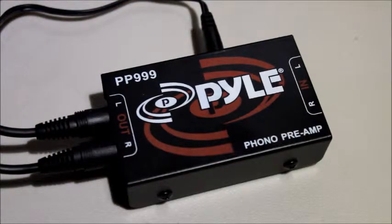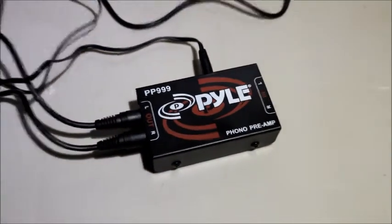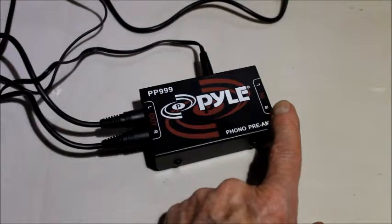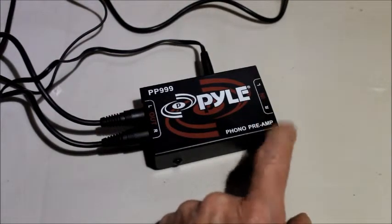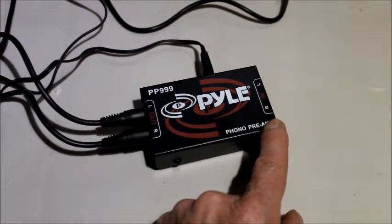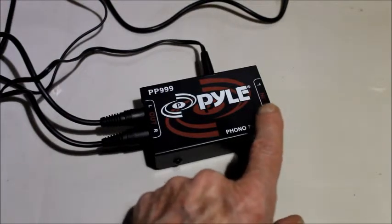That is an audio pre-amplifier that I ordered from Radio Shack. The input of that amplifier will go to an antenna. Here's the input — left and right phono jacks. I will simply stuff a 100-foot wire, one end of it, into both ends of this. It's actually a lamp cord, so I've got two wires — I'll stick one in the left and one in the right. Then run it out and maybe throw it over a tree, and use that as a baseband receiving antenna.